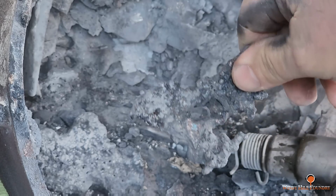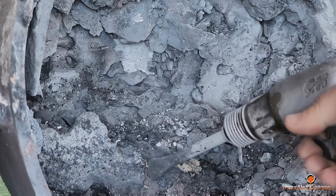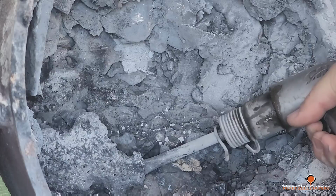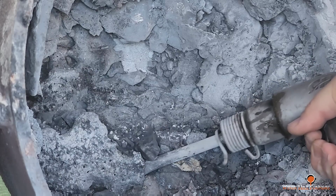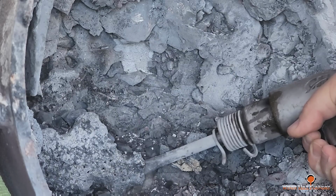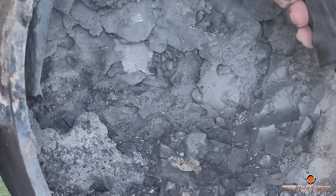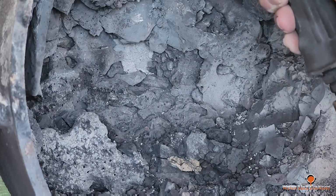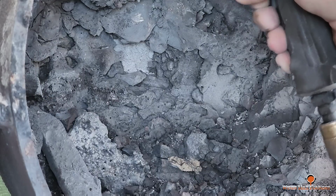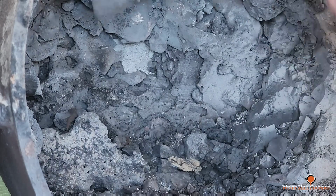Years ago, we had one that had worn so thin on the very bottom from, like I said, the reaction of the iron and the refractory. It's not a good mix, and it was washing the refractory out a little bit at a time, and before I knew it, we had parts of the steel bottom exposed. By then, I knew it was getting close to the end anyway, but we went a little too far with that and ended up having to destroy the whole bottom of the furnace just to get all that mess out of there. If I had a mess like that to deal with today, I'd just scrap the whole furnace. I wouldn't even worry about it. There's some more iron. As you can see, we got some pretty good chunks all in that mess, and it's a lot of work.